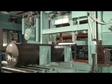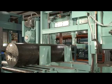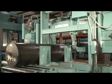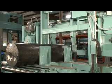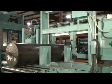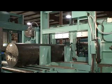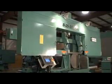What sets the WF Wells bandsaw apart from other bandsaws is our cutting force system. Other bandsaw manufacturers use the pressure differential in their cutting head hydraulic cylinder to control cutting force. This is far removed from the saw cut and includes such variables as changing material cross sections, pressure sensors, fluid viscosities, and cylinder stiction. It's no accident that saw blade deviation monitoring comes standard.